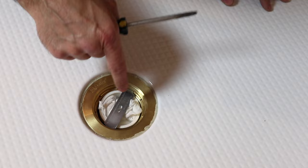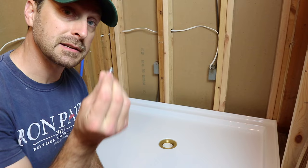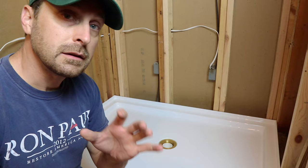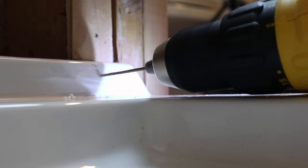When you're doing your plumbing drain, you want a little bit of flexibility in this drain pipe from below so that when you crank down on it, the pipe moves down also. You can also run a bead of silicone around inside of here on top of the gasket. Then we're going to pre-drill holes into each stud through our shower base and attach it with flathead stainless steel screws. Make sure that you pre-drill all of these because this fiberglass can be fragile — you do not want to crack it. If you crack it, you're starting over and it's going to cost you about 250 bucks.